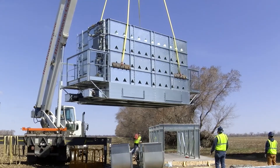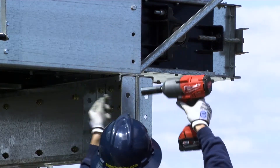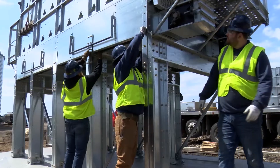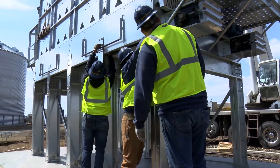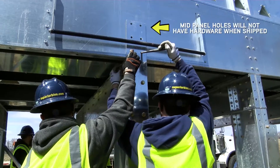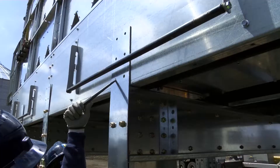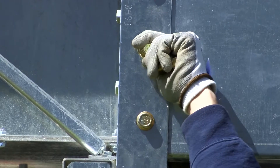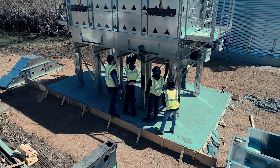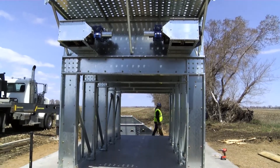Swing the tub over the leg assembly, paying attention to the discharge end to make sure the dryer is properly oriented. Remove the hardware for the platform kickers on both ends of the tub to make installation easier. One corner will typically be closer or lower, so pick a corner and start working around, lowering the tub as you go. Use alignment punches to lift the straps up to the dryer as needed. You will need to remove the hardware in the corners of the tub as well as the seam connections to mount the straps. You can reuse the hardware. Only remove the hardware from the section you are working on as you go to prevent the tub from separating. After all the straps are attached to the tub and the legs with all the hardware required, it is recommended to lift the entire assembly off the concrete to allow the legs to shift to where they need to be naturally.